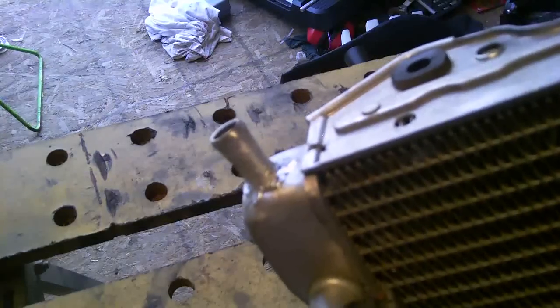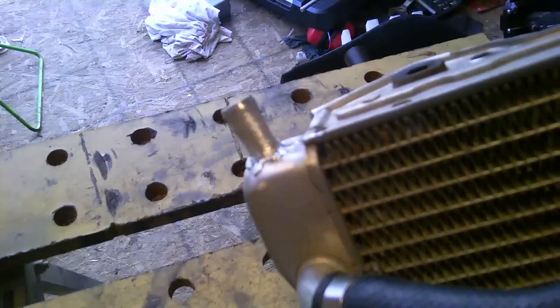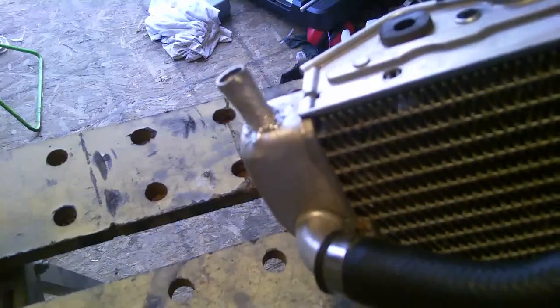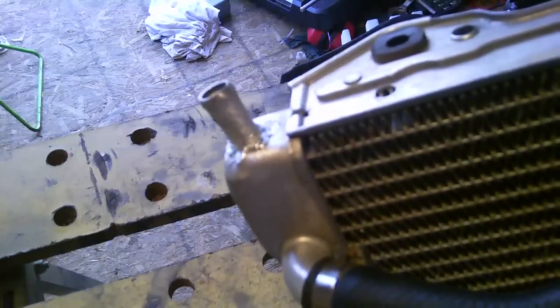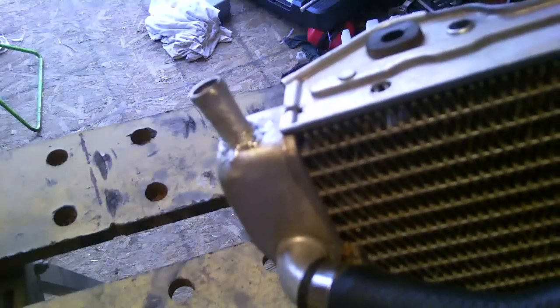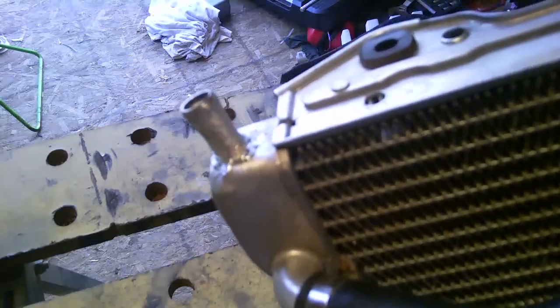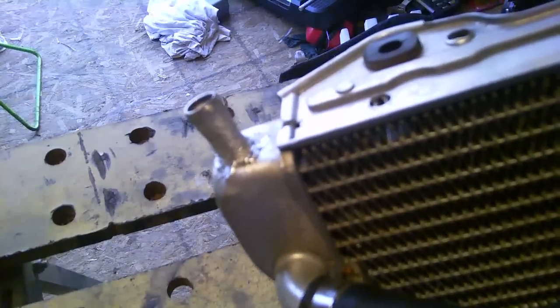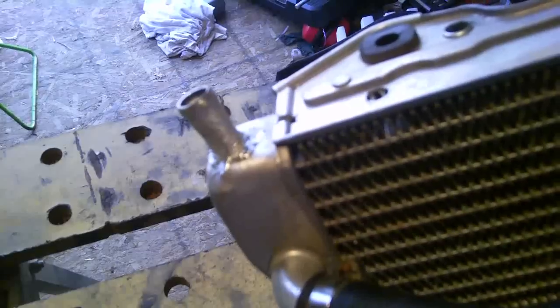So I recommend buying those low temperature welding rods from Harbor Freight and using a propane torch to heat them up and solder that on. I would say prep the area really well, sand it really well, get the oxidization off so the stuff will stick. Thanks for watching. Watch your heat. Don't go too high. You'll melt all the aluminum. Keep the heat.